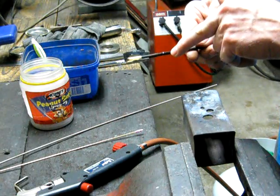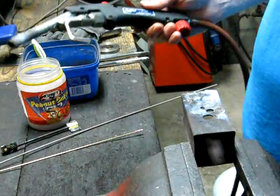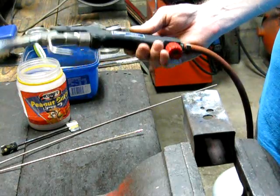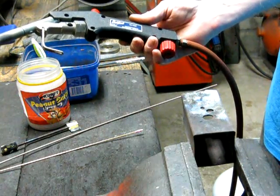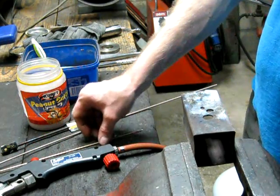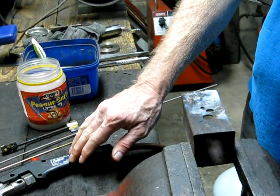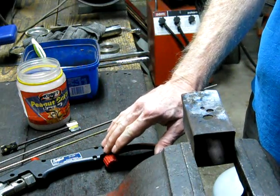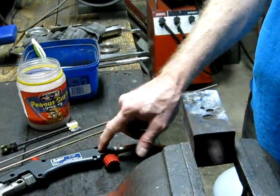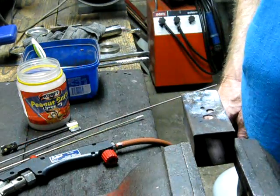It's extremely strong and hard wearing. You can use it for brazing carbide to steel and tungsten to steel — ideal for anybody with a lathe or a mill who wants to make their own cutters. You can only do it if you've got the right gun. In Australia these cost about $250, but they pay for themselves quickly because they use very little gas and are incredibly handy for workshop use. This type of gun has been around about 15 years — it is the state of the art on the LPG front for this sort of work. Get yourself one and you'll never look back.